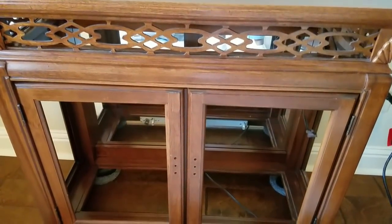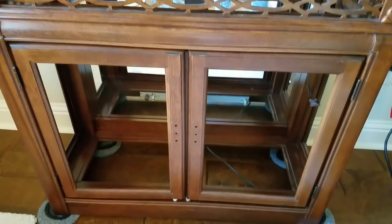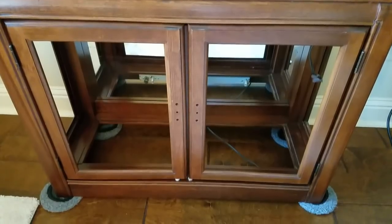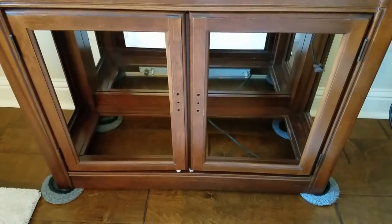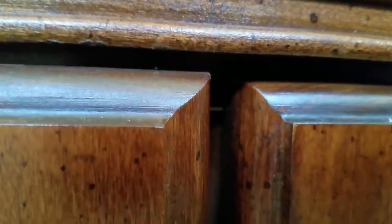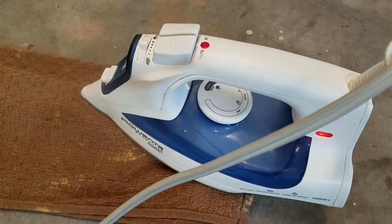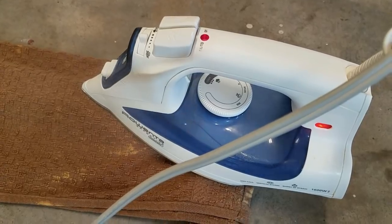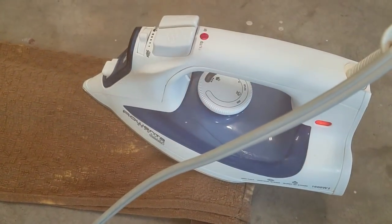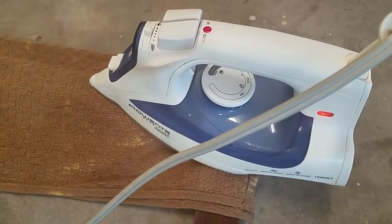It is still raining outside and we're going to move our workshop into the garage again. I've examined the doors and there is a problem — the door on the right is warped. It actually curves a little bit, and we're going to do a little bit of ironing on the door. I did a little YouTube research and also checked with a local cabinet maker, and they did recommend this. You just place an iron with a damp cloth underneath it onto the corners, heat up the wood, and then put weight on top of it for a couple of days, and that will flatten the door.